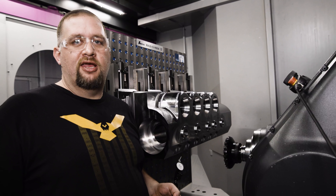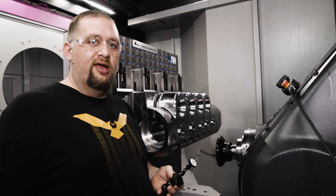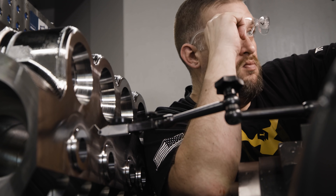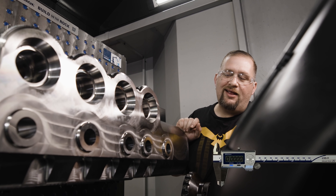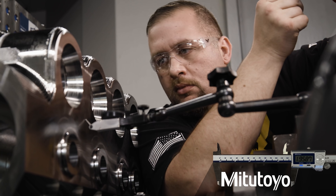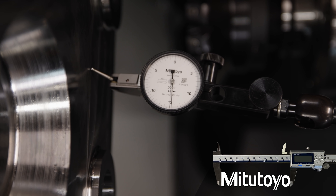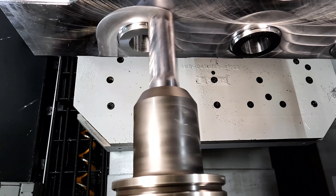Now that we've done our finished machining with both the 8 inch face mill and the inch and a quarter end mill, we're going to come in with our indicator and check the mismatch between the face mill face and the end mill face. We're getting about 5 tenths and that's not quite close enough, so we're going to come back in with that end mill and just rerun it. We're not going to make any adjustments to the length of the tool, and now that there's not as much tool pressure, hopefully we'll take off that 5 tenths and be closer to perfect.